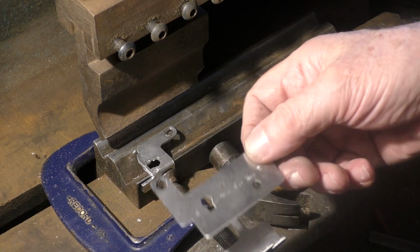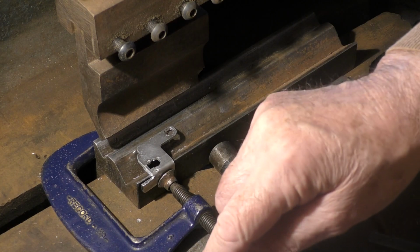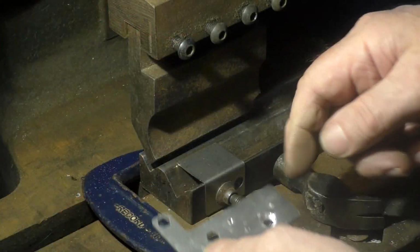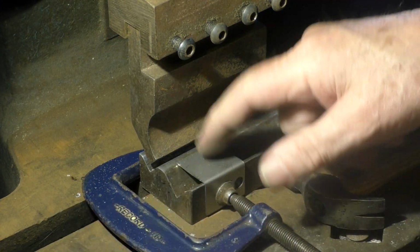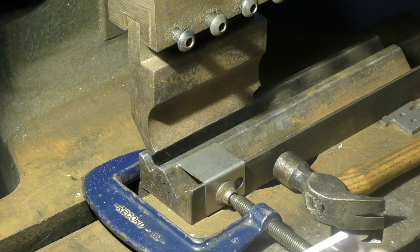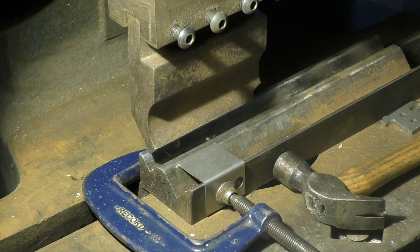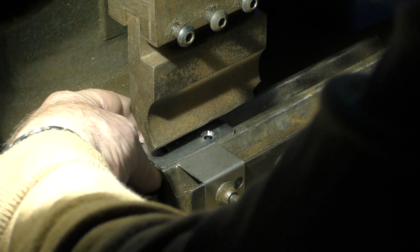Now we've got these liners that go inside here, and they've got to be bent at 90 degrees also, but there's a hole that's got to be tapped in there. There's an M3 hole. Now the bend on these pieces can't use the same end stop because of the 2mm difference. So I've got to use a different end stop, and again I've got the press set to 90 degrees, so hopefully that looks pretty good for 90. Now the great thing about the perforations in here is it forms a plane of weakness, which even if the bending tool is very slightly out, it'll follow the plane of weakness.